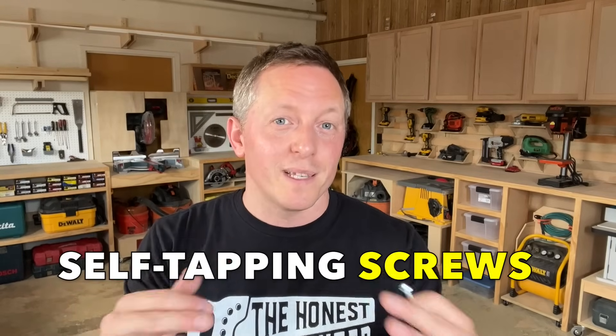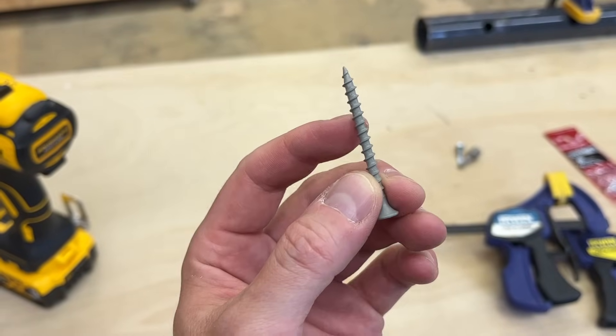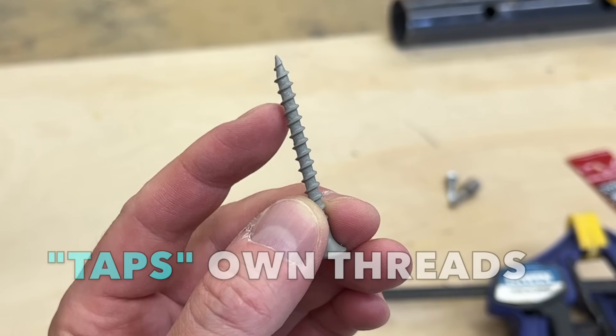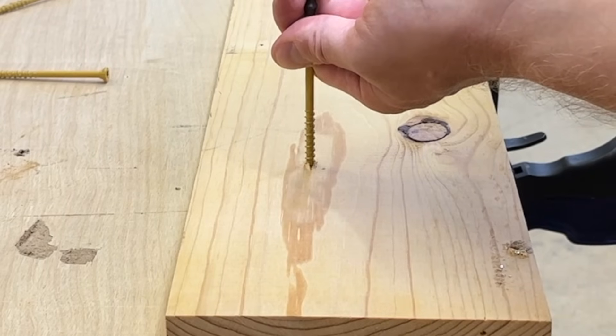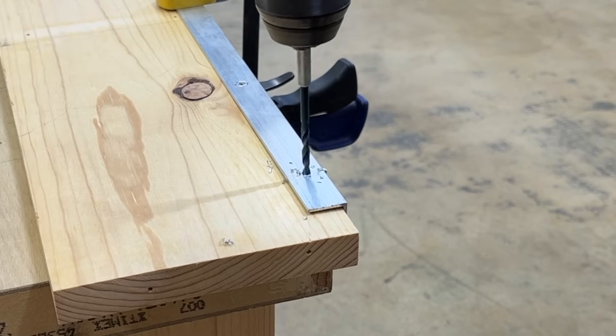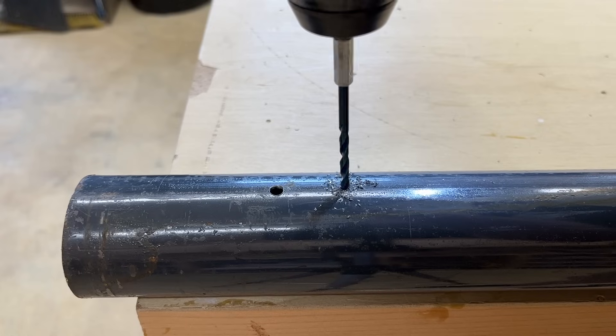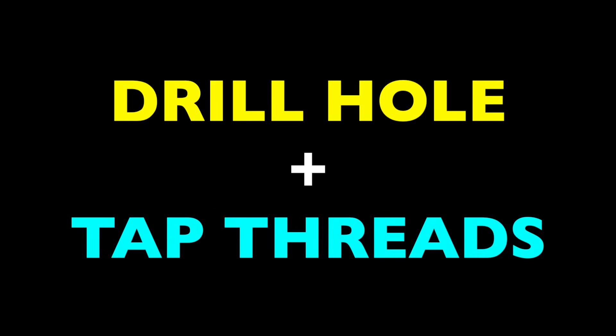These screws aren't meant to be confused with self-tapping screws. There's a lot of confusion on this topic, and even I was confused about it for a long time. These days, a lot of people call these notched screws self-tapping. But technically, almost any screw with a point is self-tapping because it taps its own thread channels as it drives. These notched ones just do it more effectively by gouging and clearing some waste material as they tap. But in some circumstances, you still have to drill your own pilot hole for these self-tapping screws, especially in metal which is too hard for this screw type to cut through. But self-drilling screws solve this multi-step problem — they drill their own hole, then also tap their own thread channels to create fastening power.